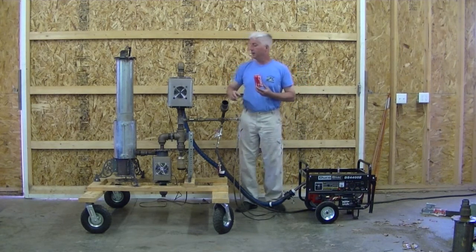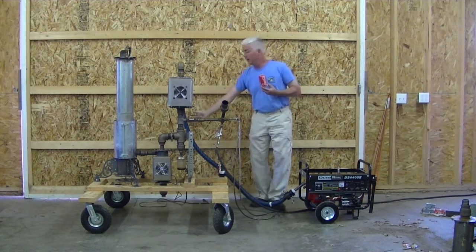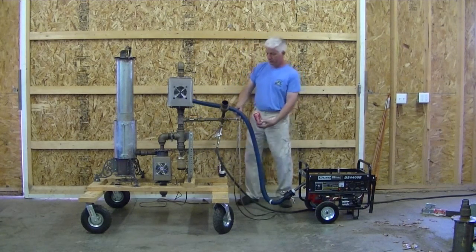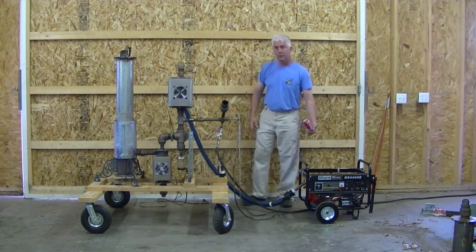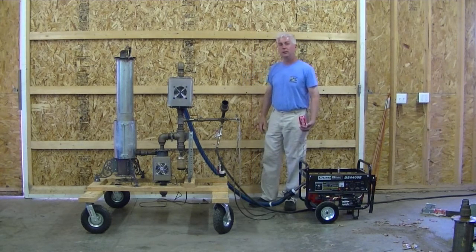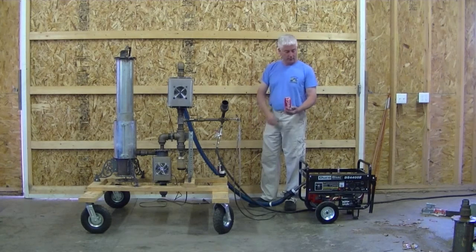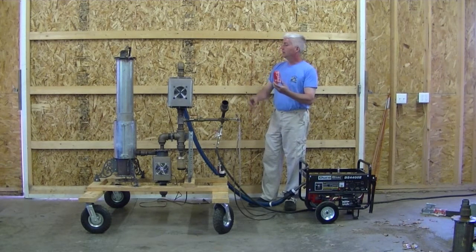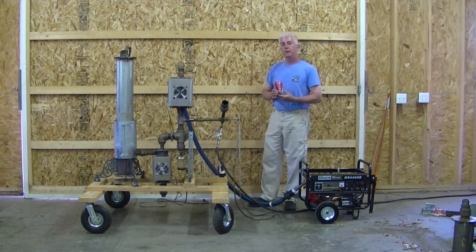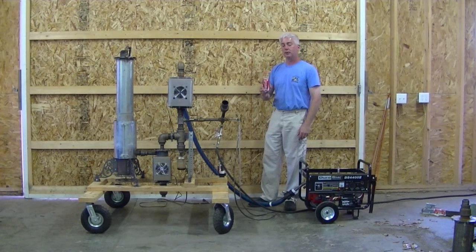I've got this big filter and all the piping in back and my blue pool hose, which is about the diameter of a can of Coke. So I've got to keep pulling and pulling, spinning that engine to pull enough gas volume through the system to get a combustible ratio at the engine. That's a lot of revolutions. That's a lot of pulling.